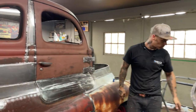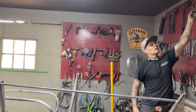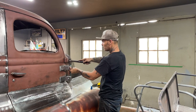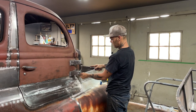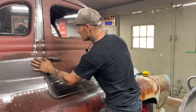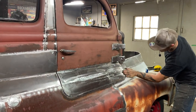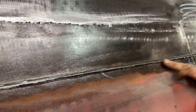I'm hoping that when the pins are in for good, I have a really good fit. And if I do not, like if I do the hinge... Fitting tighter now than they were for some reason, aren't they? It's all looking good. A little tight up in there. I can grind some more off. It's a little tight. You can see right down here where we're hitting. Yeah. So I'm going to open that up a little bit.